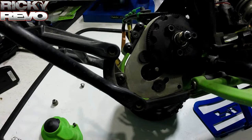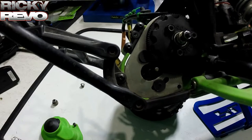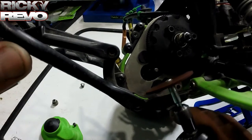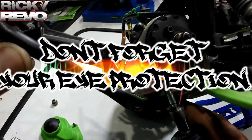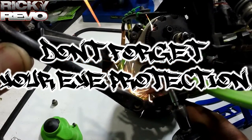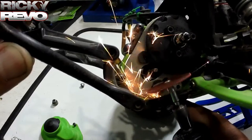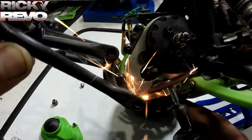It's actually really simple, guys. Rather than trying to shove another Allen wrench in there — a bigger one or whatever — or trying to grab a pair of pliers, all you have to do is put a cutting blade on your Dremel tool. What you want to do is take the Dremel tool and actually cut a slice across the bolt — whatever bolt you're using. All you're doing is making it a flat blade screw, so you can take the flat blade, stick it in there, and twist it out.